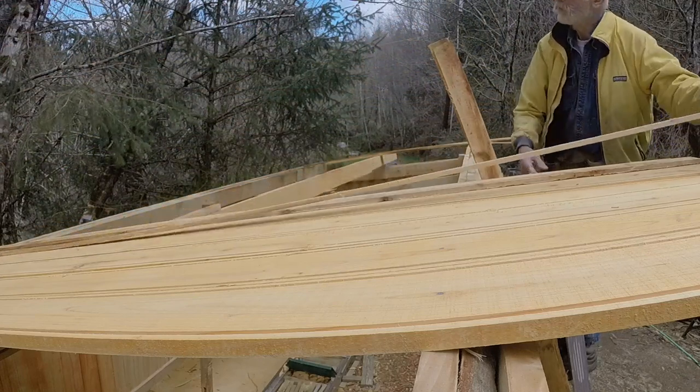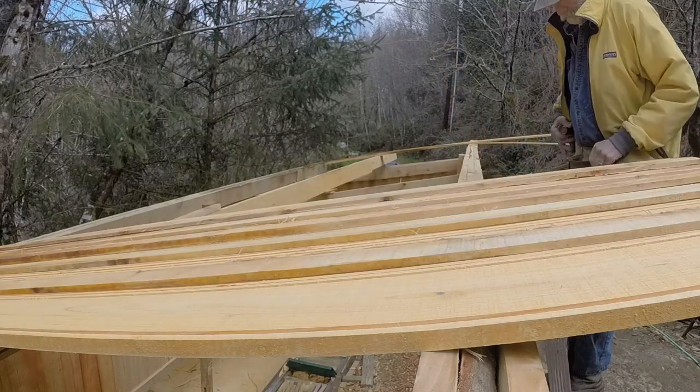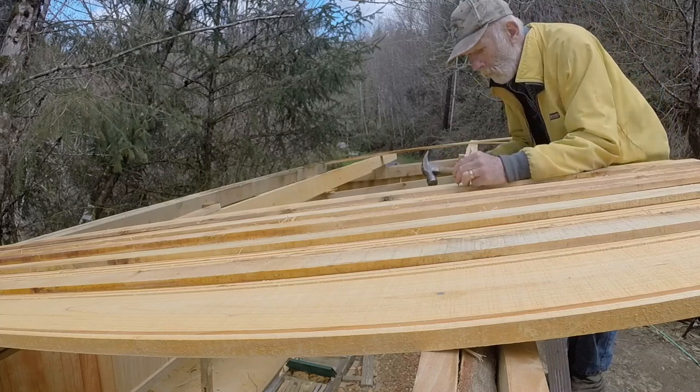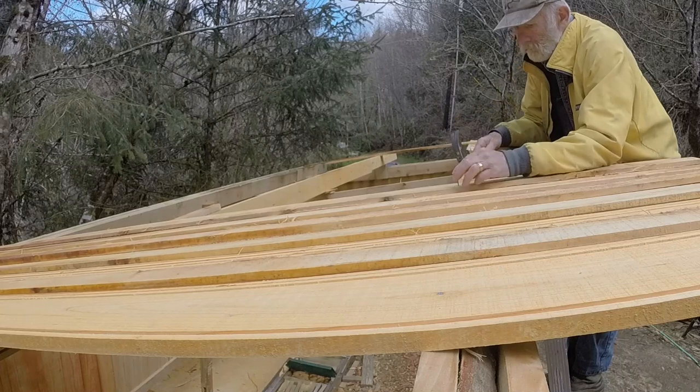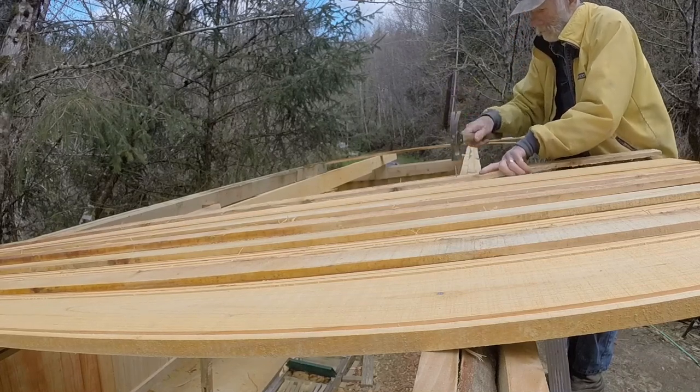Half-inch thick battens, about 2.5 inches wide, cover both the gaps and the grooves. These boards are not treated with waterproofing, not painted. We will see how it goes next time it rains.